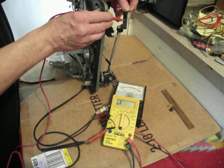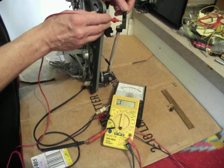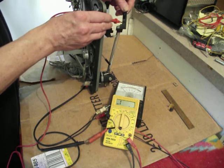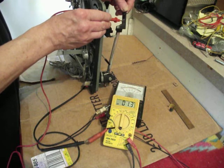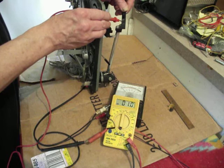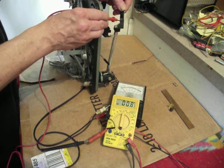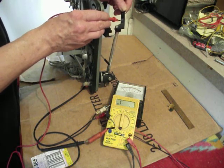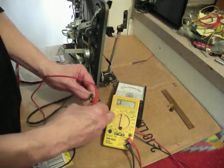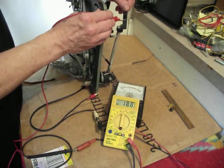There are five pins — the center one is for ground and so are a couple others. Okay, nothing there, nothing there — that's the center, so you get continuity there. Then the one over is for one side of the stereo. With one side you're going to have a ground and then a center hot wire for the stereo signal. Now I'll check the center hot.